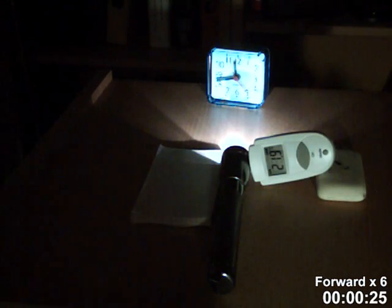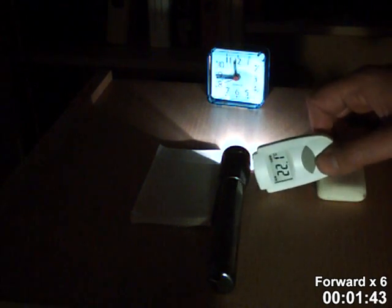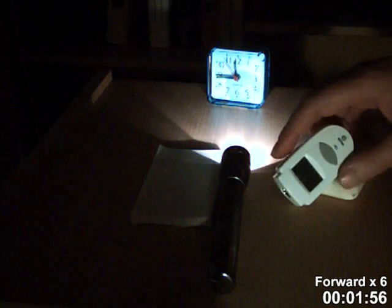There is also the theory that the metal of the hull is contracting and expanding under the heat of the light bulb, and that these movements cause electric contact to be made or broken. When measuring the temperature of the hull while the lamp is on, it becomes evident that the aluminum hull barely heats up. However, the interior parts of the flashlight heat up quite a bit.